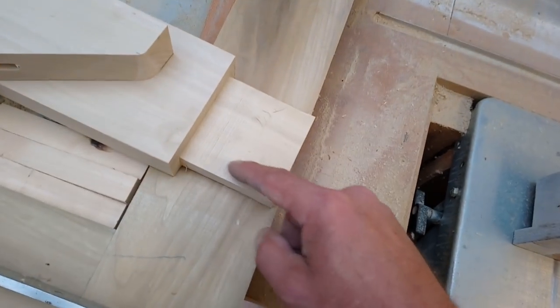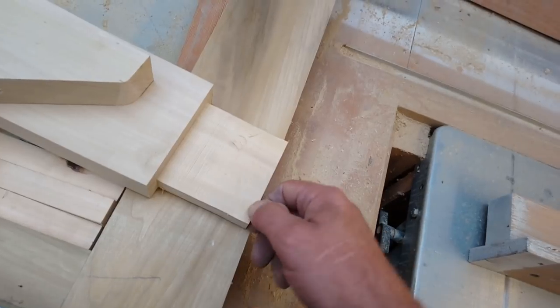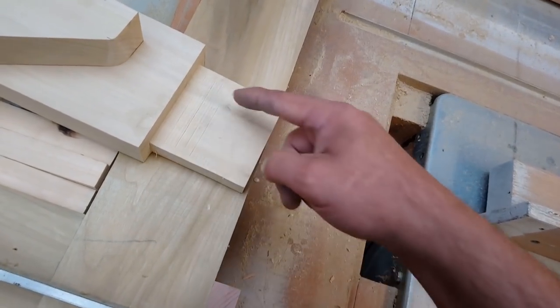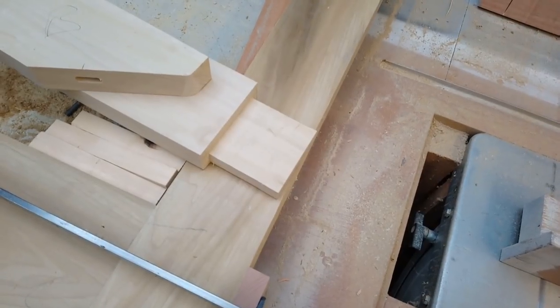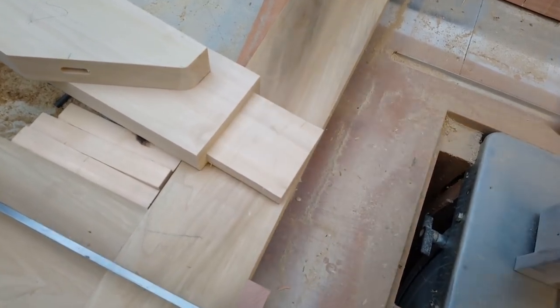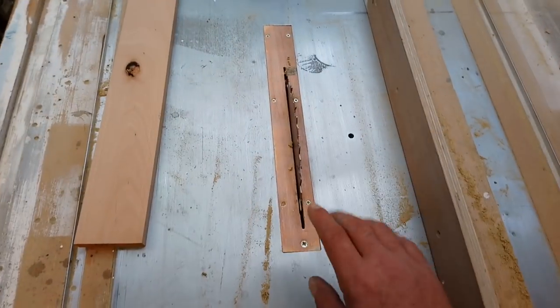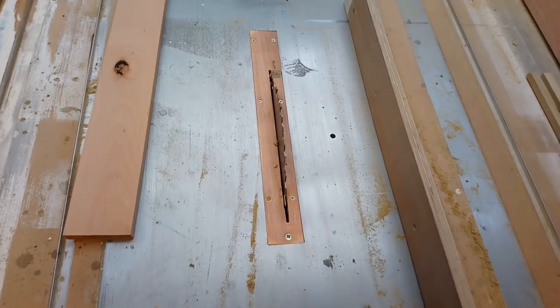In the end of the tenons, I'm going to put some wedges. Can't remember what they're called, but hidden wedges. Cut a couple of slots in there and put some wedges in. I've had a look around, can't find a piece of tulip that's about the same size, so just planed a piece of beech down. I'm going to make another little sled for making wedges.